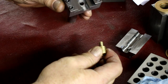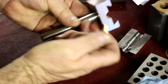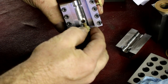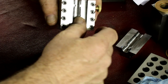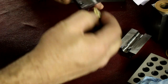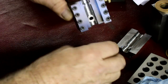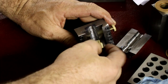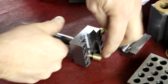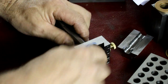I'll do a little more deburring, especially on these other edges. They want us to fit the nut now — the shaft went through here and we bored all that away. I'm going to have to deburr these edges a bit because they're pretty sharp. They say to put this in, Loctite it in place, and then come back and center drill it where it's lined up.